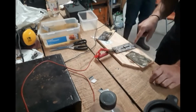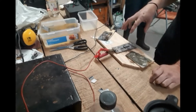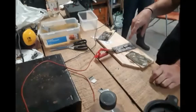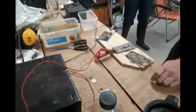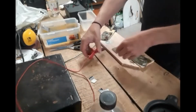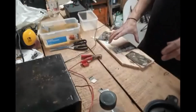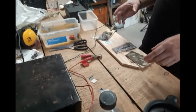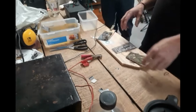There's one little bit that didn't really etch down here, and this is partly because this metal's not entirely flat. It's just some scraps that we got and shined up a little bit. But you'll still be able to see the difference when you take that resist off. It's just not very powerful. So what I'm going to do now is clean these up a little bit. I'm going to run them under some cold water. I'll do that and then you can talk.